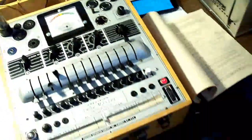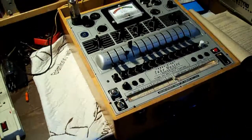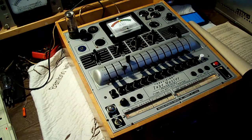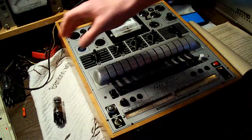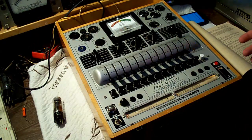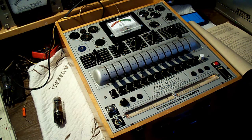So I hope that makes sense. That's all you have to do to test an eye tube on this tester — just set it up per the roll chart. The supplement chart gives you the setup procedure for all your regular switches, and then you read in the instruction manual what levers to flip in order to change the eye from open to close, and then you test the tube that way, disregarding the meter reading. Hopefully you'll find it useful. If anyone has any questions regarding this tester or how to test a magic eye tube, please let me know. I hope this answers your question.